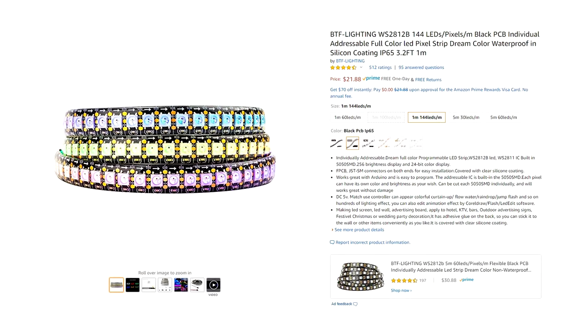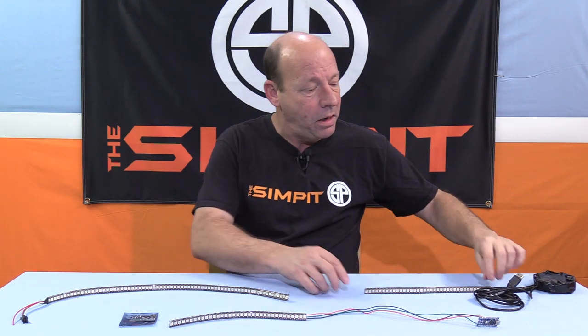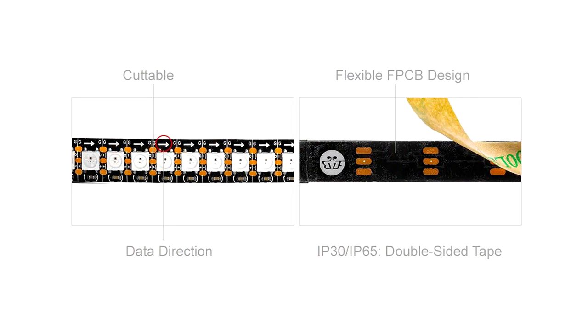On the 144 LED strip that I bought, it had an extra set of wires on the other end. These are for stringing multiple chains together, not for wiring to the LEDs directly. So I decided, in a completely random manner, that I wanted an LED strip of about 37 lights long. I figured that was about the right length for what I intended to use it for. So I had to actually cut my strip down to length.